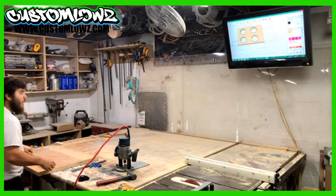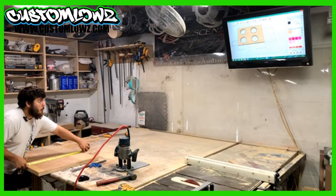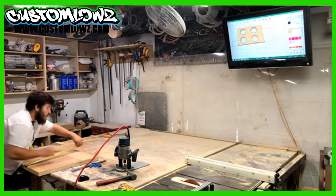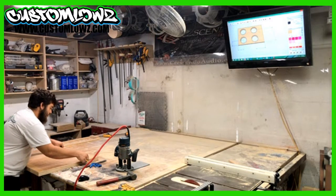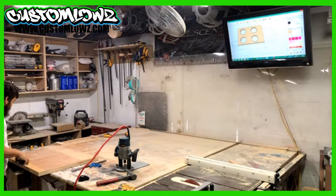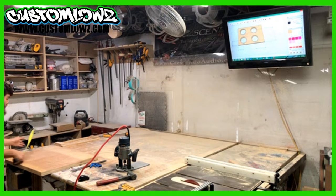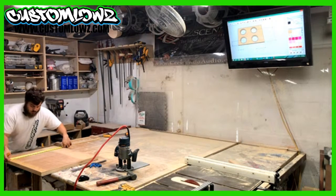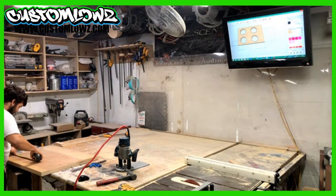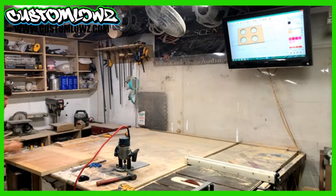And then we know our next sub hole is 18 inches up from the bottom. So we'll mark 18, go over 11 5/16, mark that out. And then we got our center point, circle that so we know which one it is. Next one is 7 9/16 over, 18 inches up. So we'll go ahead and mark 18 inches up, 7 9/16 over, circle that center point there.